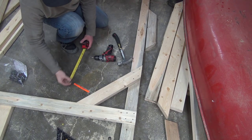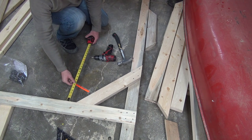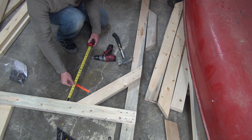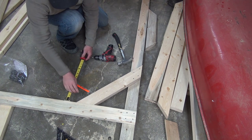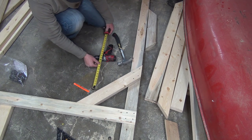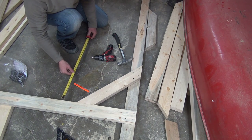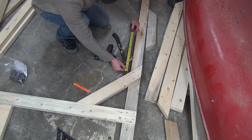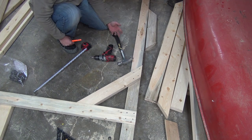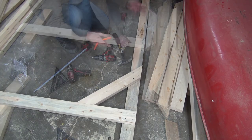When you put in your next brace, keep in mind how deep your canoes are. If I was to put 16 inches here we'd have problems with this brace, so you're going to want to drop it down a couple of inches more just to avoid the brace. I'm going to do mine at about 26 inches. I like to have a bit more space between my canoes so I'm not bumping it against the brace when I lift it in.